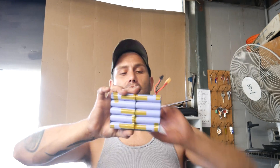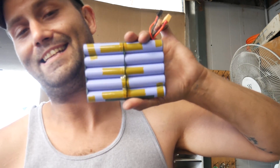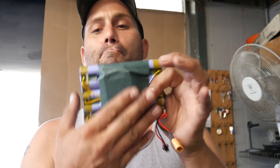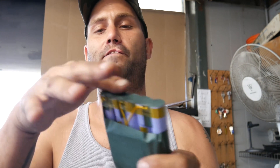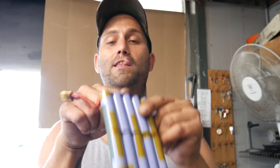As you can see here, my vape with the back off takes three cells just like this. These are called 18650 size batteries — like you have AA, AAA, D, or C. That's the designation used to describe that size battery, and this size is 18650. As soon as I get the shrink wrap off the battery pack, the first thing I notice is it's got a bunch of 18650 batteries in it. On top it's got a protective covering on both ends and actually in between the batteries as well. That's to prevent anything poking the battery — say a metal object getting in there and shorting it out.